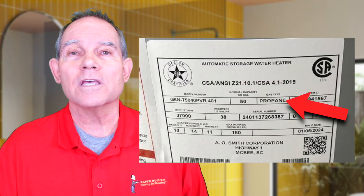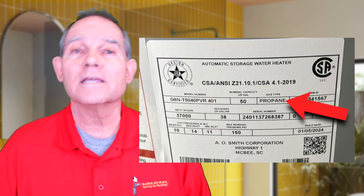Also, it may have copper coming up out of the ground to it, which is very common for LP gas and not so common for natural gas. Quick side note: copper is allowed for natural gas still, but you have to be careful how you install it. There are very specific reasons behind it — the odorant in gas can corrode and make copper fail. So if you see copper on the gas line, don't necessarily think for sure that it is LP gas. Make sure and identify your regulators.